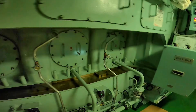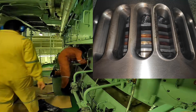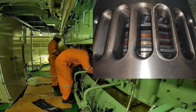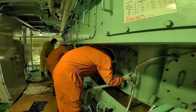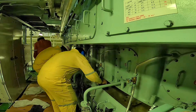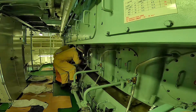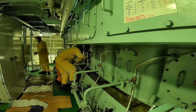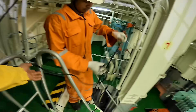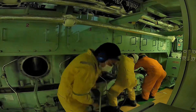When good and steady service conditions have been achieved, the running surfaces of the piston rings and cylinder liner will be worn bright. This also applies to the ring undersides and the floor of the ring grooves, which however cannot be seen until a piston is pulled. In addition, the rings will move freely in the grooves and also be well oiled, intact, and not unduly worn. The ring edges will be sharp when the original roundings have been worn away, but should be without burrs.